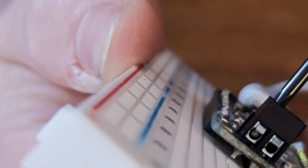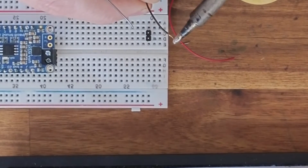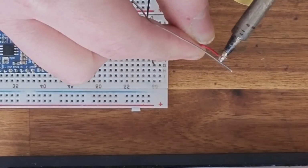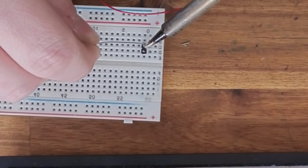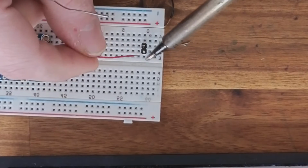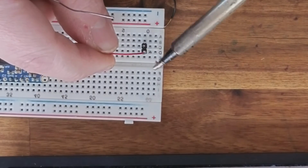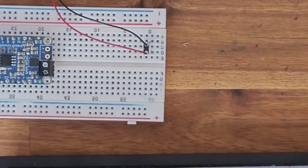The screw bottoms out before the bottom of the thing, so it was too loose for me to hold in the speaker wires alone, so I had to first wire the speaker wires to, fortunately, those 2 leftover pins from the beginning. So I get a little bit of solder on the pin, I get a little bit of solder on the wire so that you can touch them together and just melt them and they'll work. Again, not pretty, but metal's touching metal, and that's all that matters.